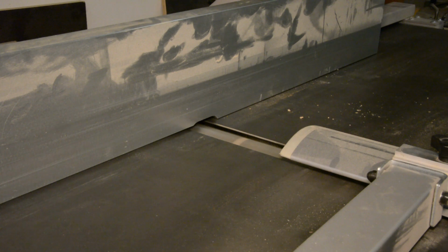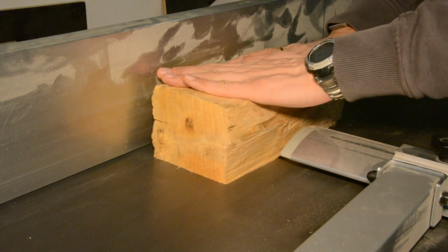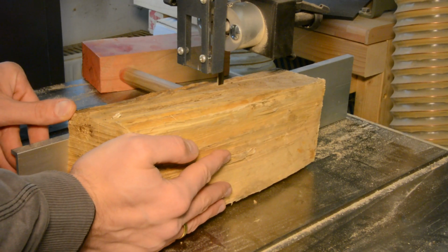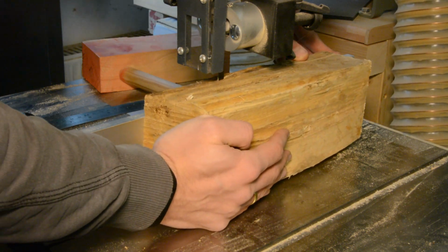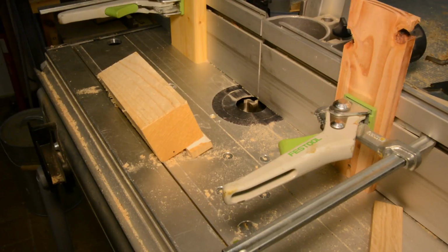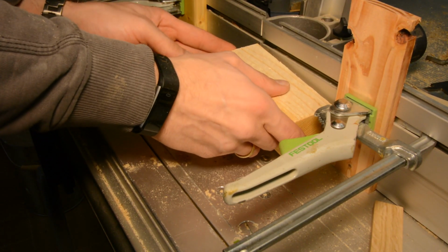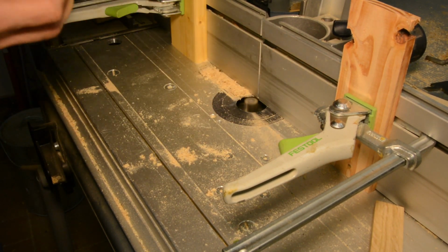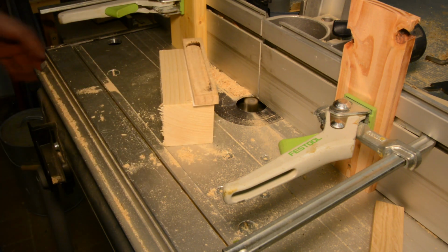Now, this pen needs a nice box. As material for the box, we use a piece of firewood. I flatten one side of the wood on the jointer and then cut it to size on the bandsaw. I first tried to route the box on the router table, but the operation did not feel safe and sanding the burn marks off would have taken quite some time. So I let the CNC do the hard work and cut the boxes from a piece of firewood.